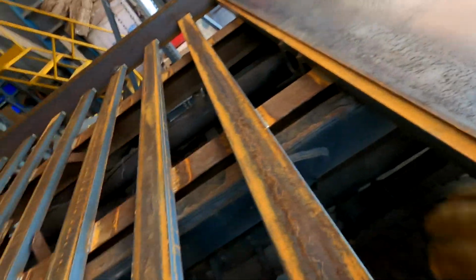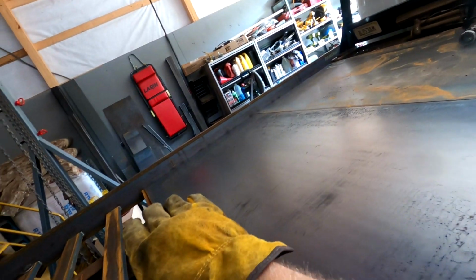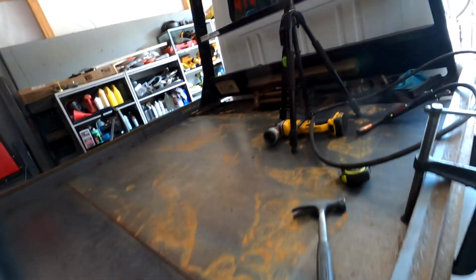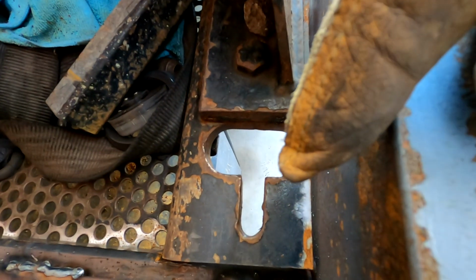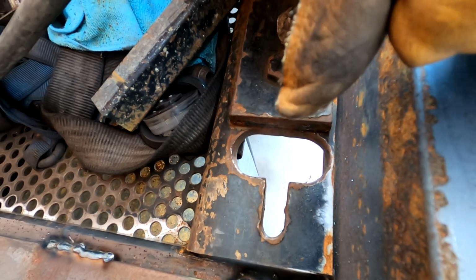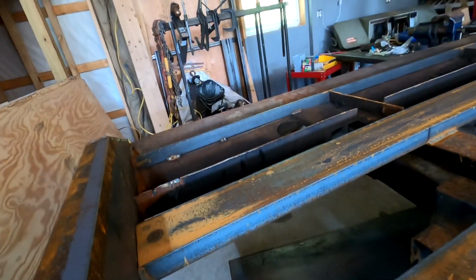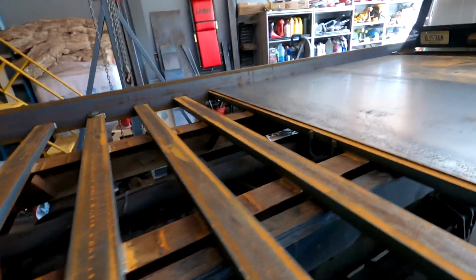So as you can see, I was doing stitch welds across the front of the truck, and all down we're going to weld all the seams, and then all the seams all the way across. So this is 2 sheets, and then somewhere back in this area, so that's the back, that's the front, so the middle of the bed is right around here somewhere. We're going to install either double banjos, which if you're not familiar with terminology, that is called a banjo. Normally it's like kind of more circle-ish with that piece sticking out. You can drop the chain in there and then lock it in place. So they only have a banjo two up front, and then there will be one right where the hole is. So we're thinking about putting another one up in here somewhere for extra tie down space.